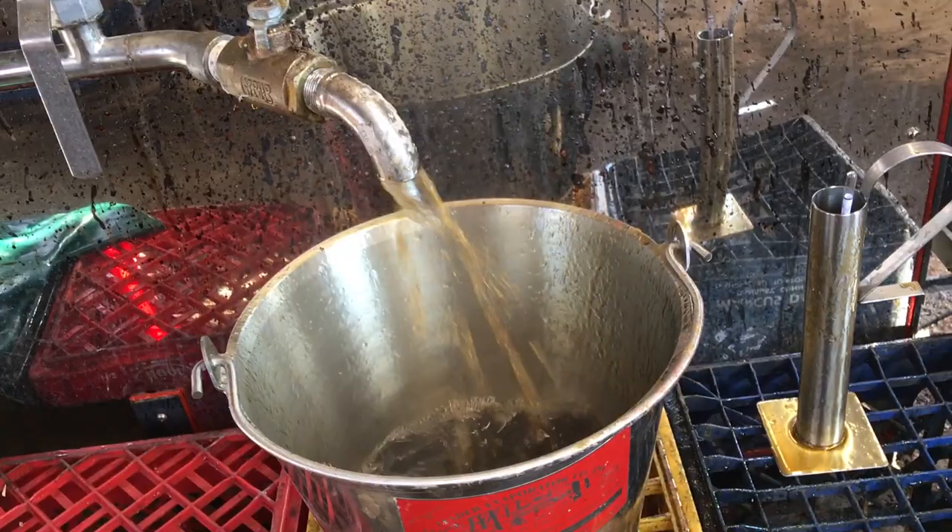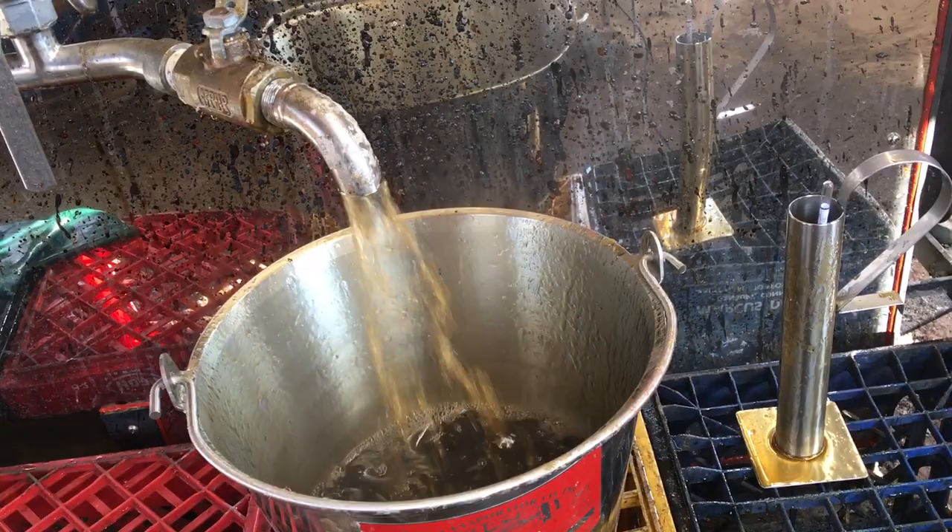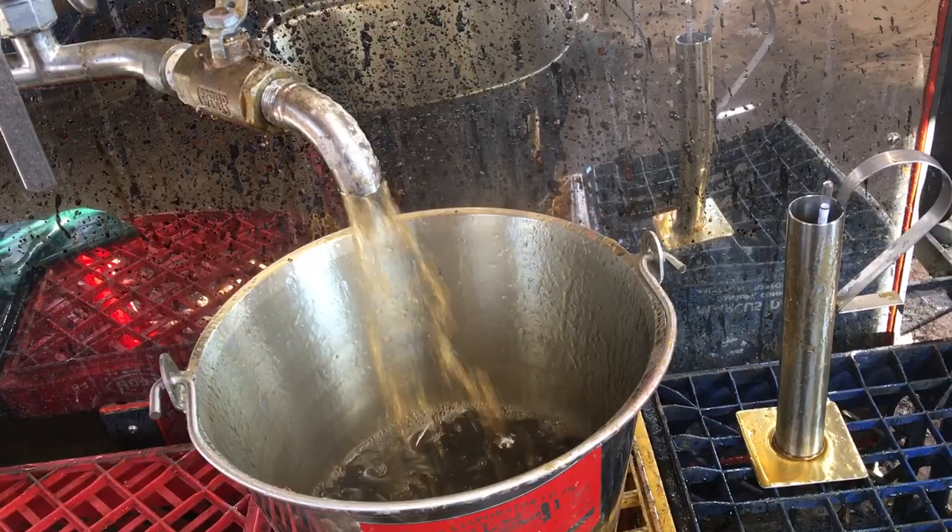By leaving the pan a little shallower than our operating depth, when we start up next time and open up the valve, the float will allow liquid to come in and it'll push the rest of the sweet right around to our syrup compartment — rather than being too deep and just sitting there boiling and mixing all the time. That's why we're doing this.